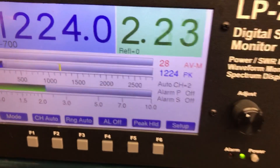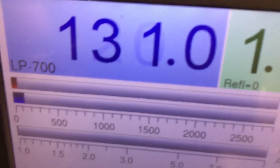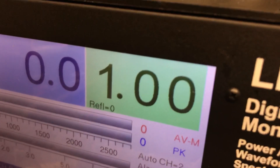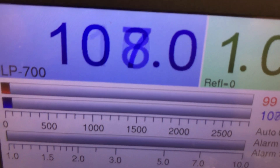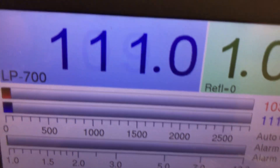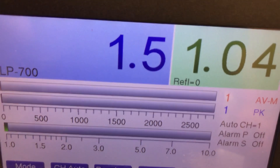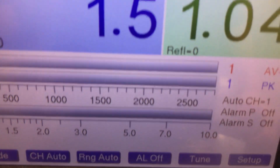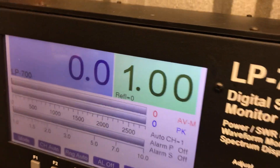Here we're going to look at it — turn it back on to mode here so you can see the key. I'm going to turn my mic right now, trying to get where you can see the key. So we're dead-keying about 100. That's 1.5 watts in, so about a watt to two watts tops is all it needs on input — that's where your audio is messing up.